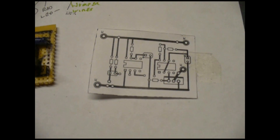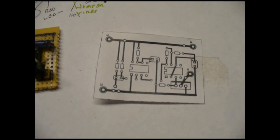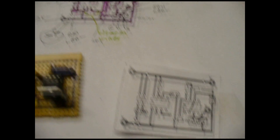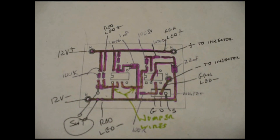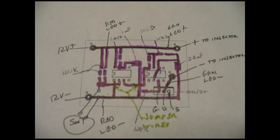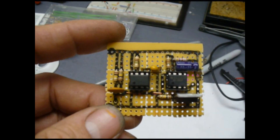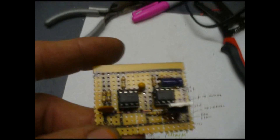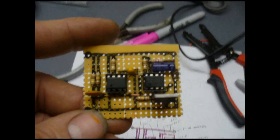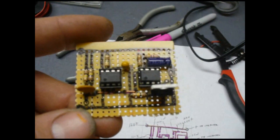It's pretty nifty — it's a freebie. I'll post links on the projects page on DinoFab. It's a free download, and they'll also make the circuit board for you. I went along, put in all my components into the board, put a pink mark on all the traces as I did them. I used one of those Radio Shack prototype boards — just full of holes — and took this little piece of paper, taped it right to the board on top, then flipped the paper back and forth to transfer everything to the board to see where my traces and components went.